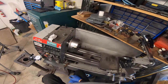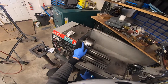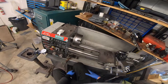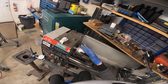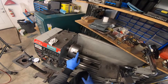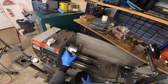We can leave magnets on there and hope that they don't interfere with stuff, but they're going to collect metal shavings. We could get a chunk of metal and weld it on, but most people don't want to weld on their chuck. Or we can remove weight 180 degrees from where our weight is. 180 degrees from the C position, we can remove 31 grams, and 180 degrees from the B position, we can remove 13 grams.